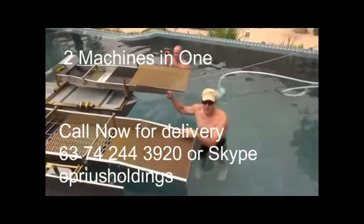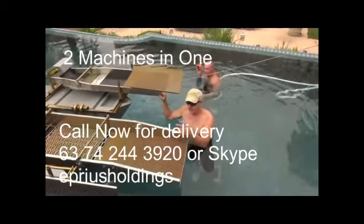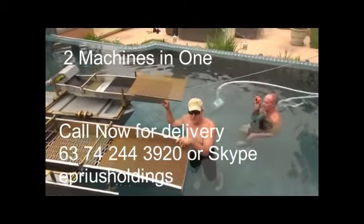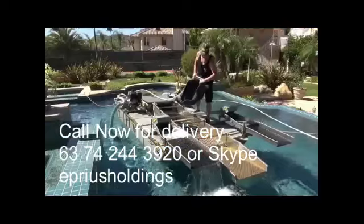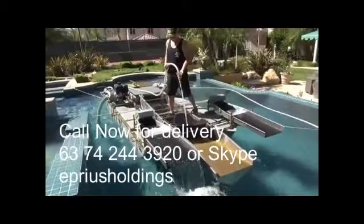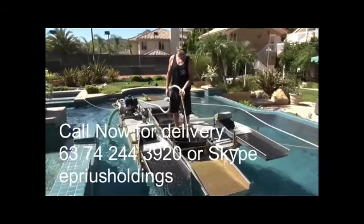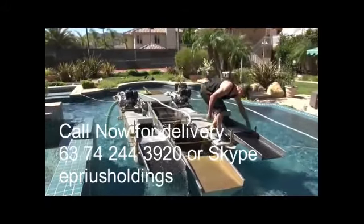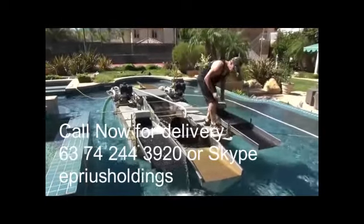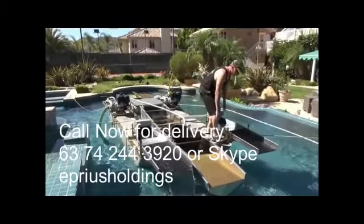I've already got the optimum recovery system right here, so you might as well take advantage of it. Most of the time when you're running a 6-inch dredge, you're going to be transporting maybe 4 or 5 gallon buckets of concentrates at the end of the day — that's a lot of material to sort through, and it can take hours and hours to process. But you've already got the ultimate concentration system right here, so the best way to handle it is to let the dredge do the work. I'm going to clean both my side boxes out, and that's probably where I'm going to find the bulk of my 100, 200, 300 mesh gold.